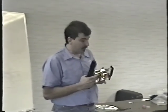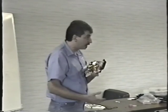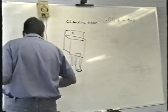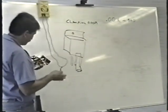All right. Remember from the videotape, these things have a built-in overcurrent protection system, OCP, overcurrent protection. When the output diodes fail, the plus 12 or the minus 5, if they short circuit, it shuts off the whole power supply. It shuts off the entire power supply. You get no output from any of the outputs. All right, now, these diodes do not test good in circuit. When you go to check these diodes in circuit, they do not test good.